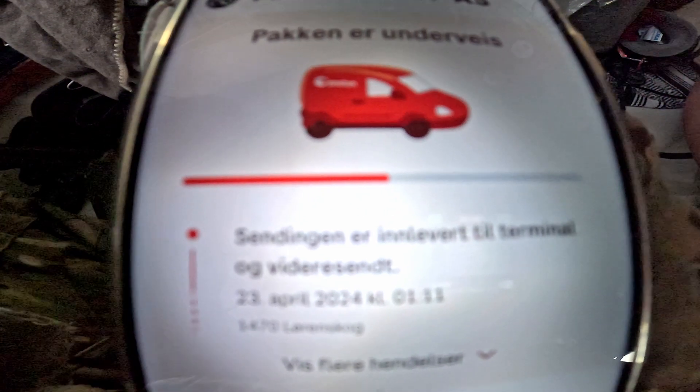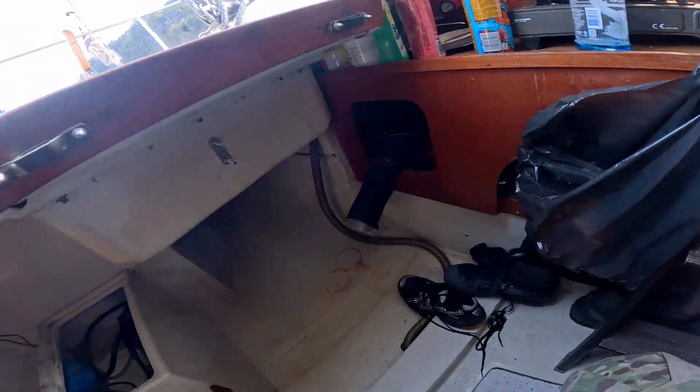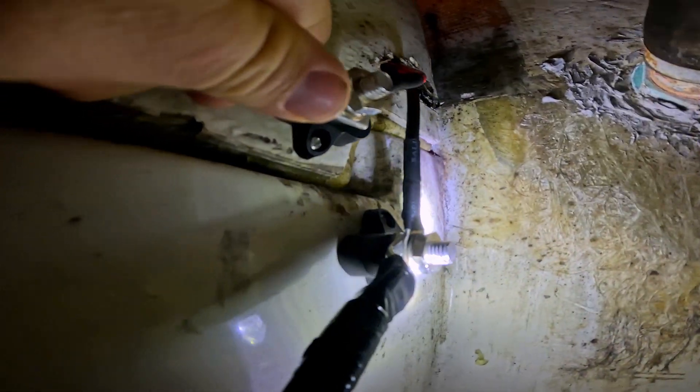I got a slight setback because the shop I ordered the solar panels, batteries, and everything from didn't have a 100 amp fuse — I had to order that from a separate shop, and my tracking shows it hasn't been moving for days. So what I'm going to do today is test the cables on one of the batteries. I'll go out in the fjord, run it full throttle, and just check that I don't get any heat or anything starts burning. I've been going full throttle for the last seven or eight minutes, running for 40 minutes total, so let's go downstairs and check the connections. Battery connections — both cool to the touch, no heat whatsoever.